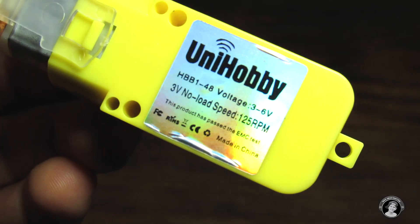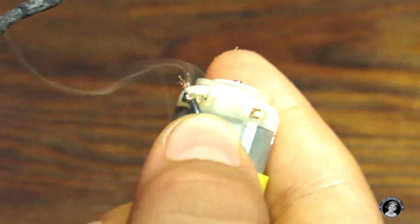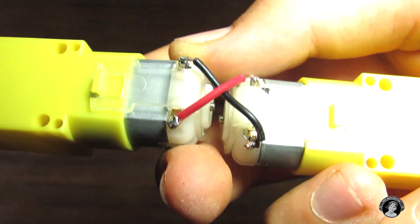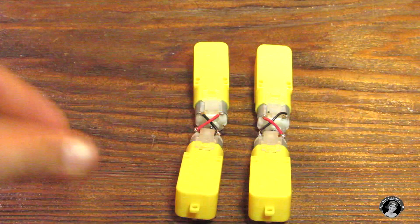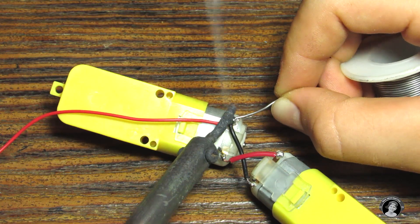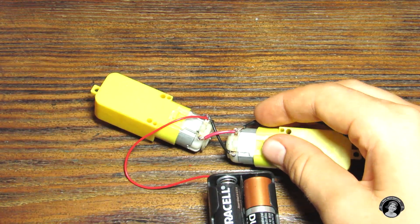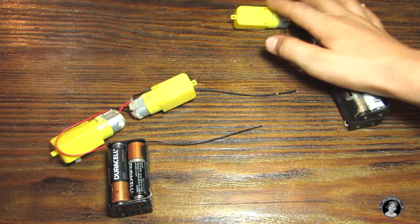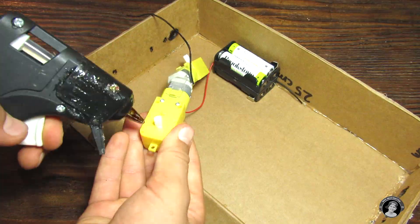Then you're going to take a two centimeter piece of wire, electrical wire, and solder it onto one of the contacts of your DC motor — let's say this one's going to be the positive. And then solder on this red wire that measures two centimeters. You're going to repeat this process with another two DC motors. Then you're going to solder the negative wire from your battery pack onto the positive wire on one of the pairs of DC motors, and then take another random wire, not from the battery pack, and solder it onto the negative side wire of the DC motors. Do this one more time.